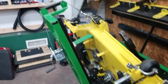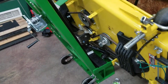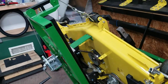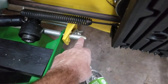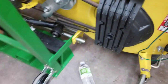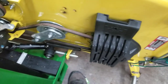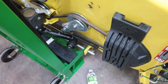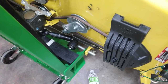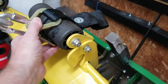I've got this contraption I made — it's got a couple pulleys on top and a boat winch. I kind of used the design of a hand cart. Attached to it is some three-quarter inch round steel, and I just push this whole unit up onto the deck. These are the same hooks used on the tractor, which has that same three-quarter inch solid round bar on it, stationary on the tractor.